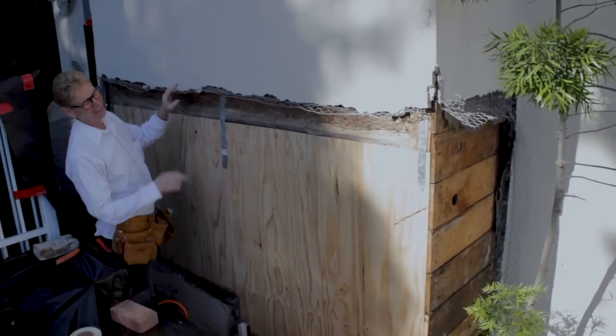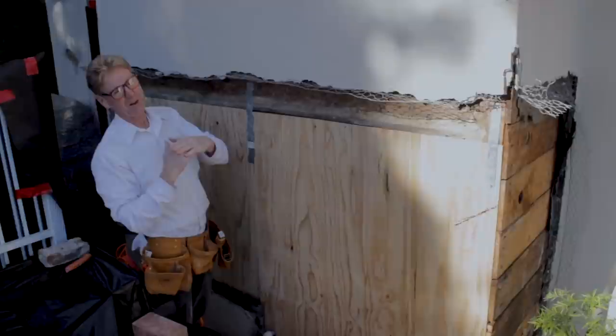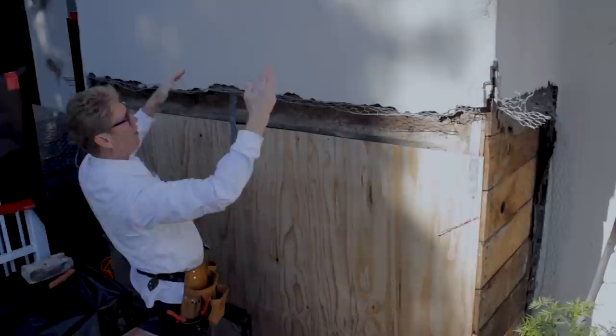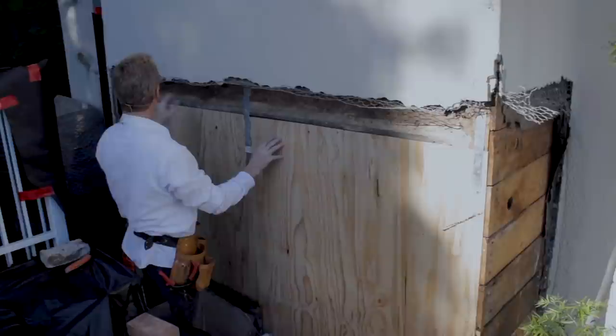He asked how I knew it didn't come from the top. I said I looked already and saw a parapet up there. Parapets are notorious for leaking after 80 years — the first 50 they're okay but then the caps kind of melt in the hot sun. He's got a flashing cap on there now. If it leaked at the top it would funnel all the way down, so all of this would be bad up to that window. Anyway, he moved the electrical panel or had PG&E redo it.